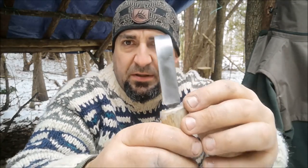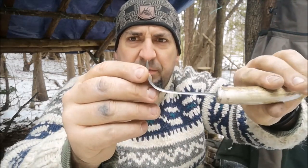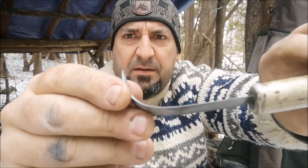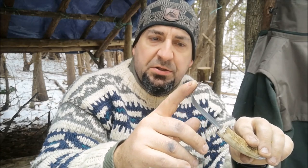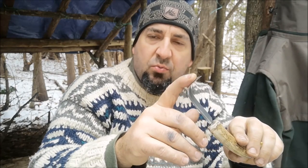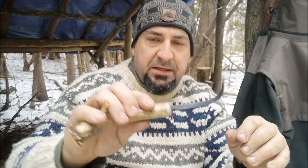I also took the filing off the back. Now the top I wasn't too concerned about. So you can see there the edge, the bottom's polished smooth. And from there, then you can heat. And I was nervous about it, but I used the torch and heated the end of it and rolled it over a piece of doweling I had in the shop to get that profile.